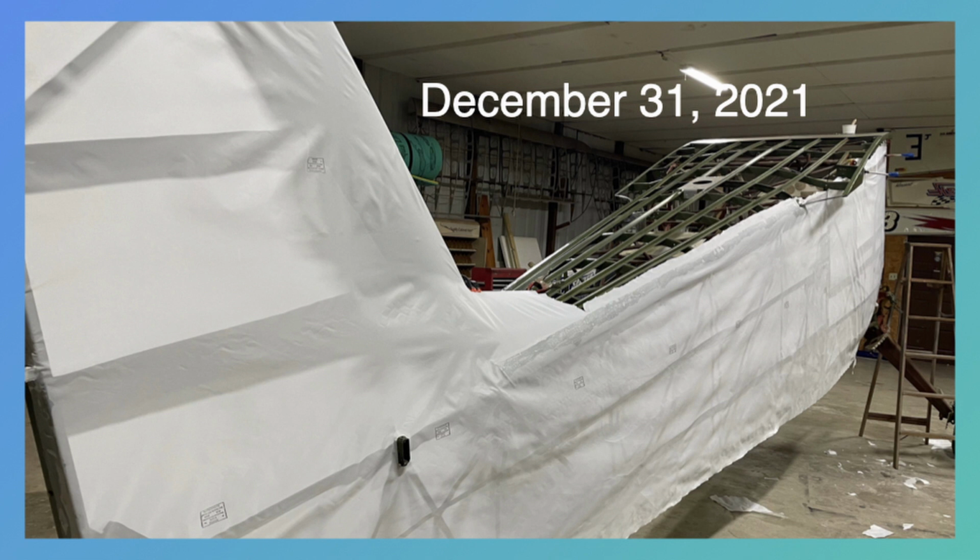The system that we used was AirTech. They're located in Arkansas. Do you like their primer? The primer's actually really good, but you've got to treat it right, because that's what my aircraft's done in it. You've got to let that primer gas off or you're going to get a crummy finish. It sands really nice, and quickly.